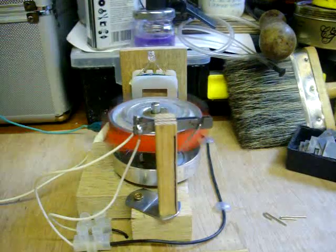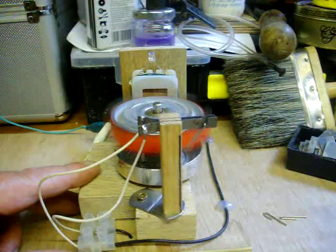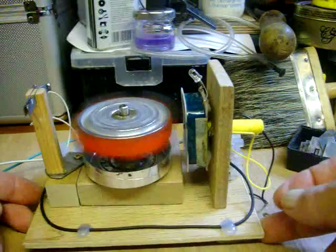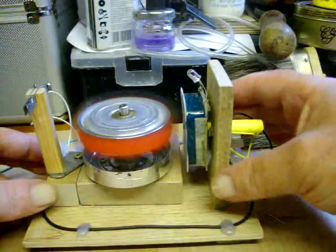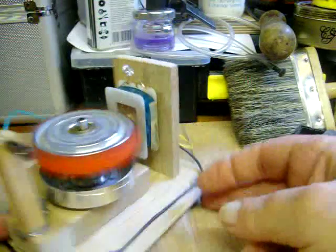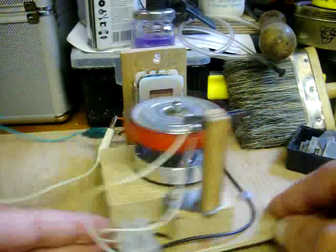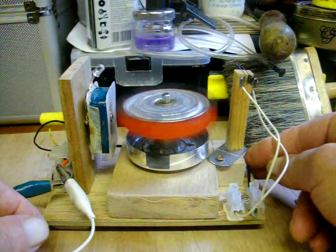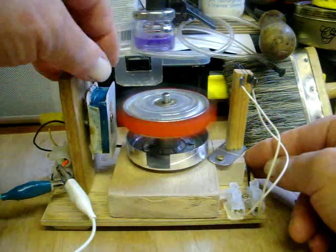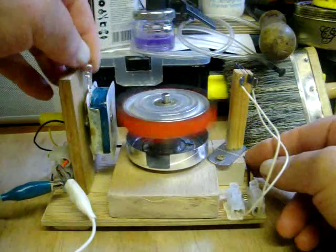Anyway, I hope it's been helpful if somebody runs out of reed switches — they can always adapt this. It seems to work fine. It's just your basic coil and transistor underneath, and the magnetic head out of a little video recorder. It goes faster now. I think that LED's blue, probably because I've not got it soldered.